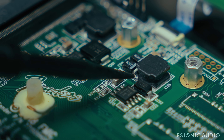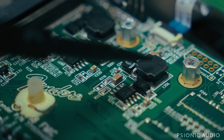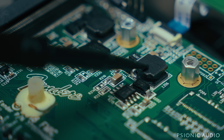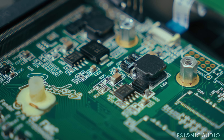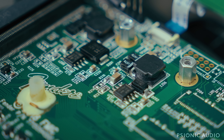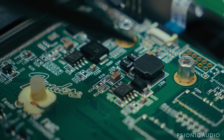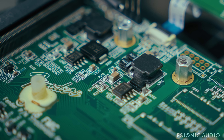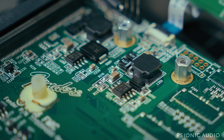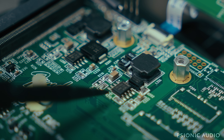This inductor here was a pain in the butt. As I said about through-hole components, it can also just be high-rise SMD stuff like this inductor — it has four contact points. To get it out I would need two soldering irons; I couldn't get all four heated with just one iron even with the ChipQuick. My other soldering iron is an ancient Hakko that's seen better days and very temperamental. So I worked around it and was able to change out what needed to be changed out.